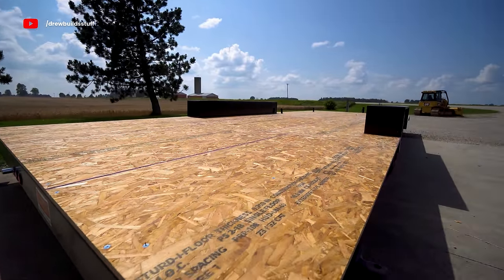Then I confirm my header size is the same size my blueprint says, which is 6.5 inches. And then I ripped a 2x8 on my table saw and cut it to size. And then nailed in 2 of these boards as the header for my doors and windows.